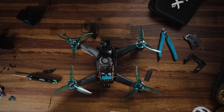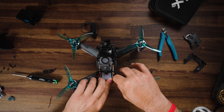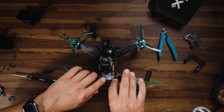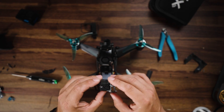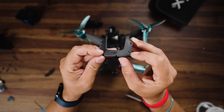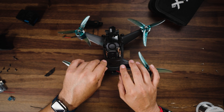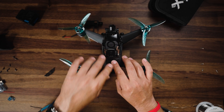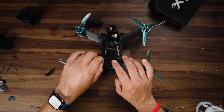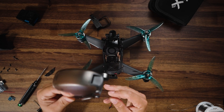With that being said, we can go ahead and add that back. This is just a little thermal pad that helps absorb the heat from the ESC. Now we can go ahead and remount our heat sink — it does have a little stop gap here, so we shouldn't have any issues. Now we're ready to put this plastic piece on the backside. I went ahead and added a little bit of a cut to mine — that's going to allow me to slip these cables through without pinching them, because the last thing I want is those cables cut mid-flight. Now we can put the four screws back in to hold the heat sink down.